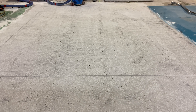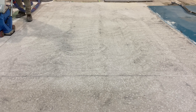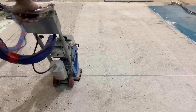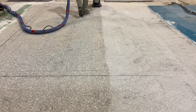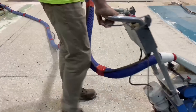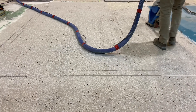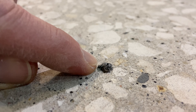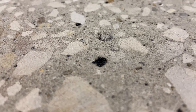Following this is a shot blast. This de-dusting process is responsible for removing all the dust that the vacuum wand could not — the dust created during grinding that was subsequently forced into the pores of the concrete. The shot blaster agitates the surface of the floor under negative pressure and extracts that dust fully. This results in a difference in appearance because the floor is clean of fine dust and the surface pores are exposed. The shot blaster removes that dust from all these small pores.